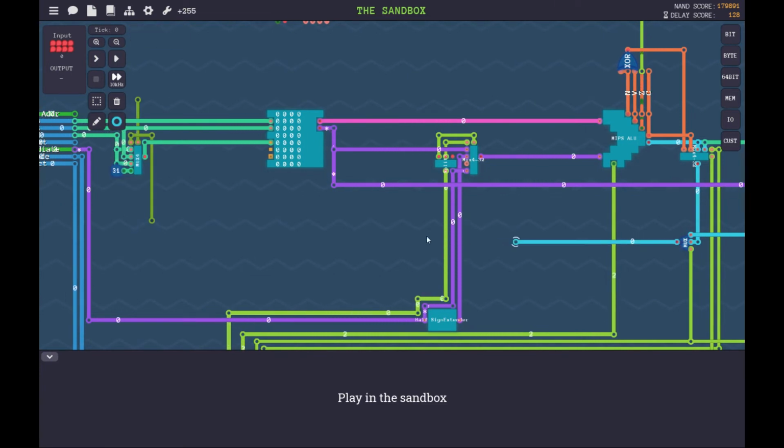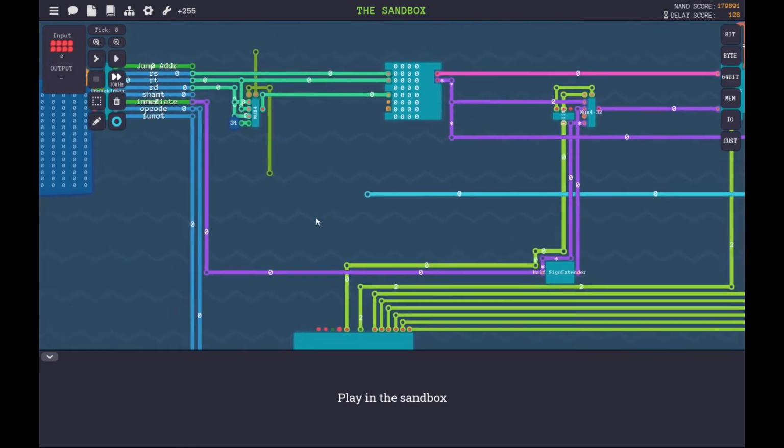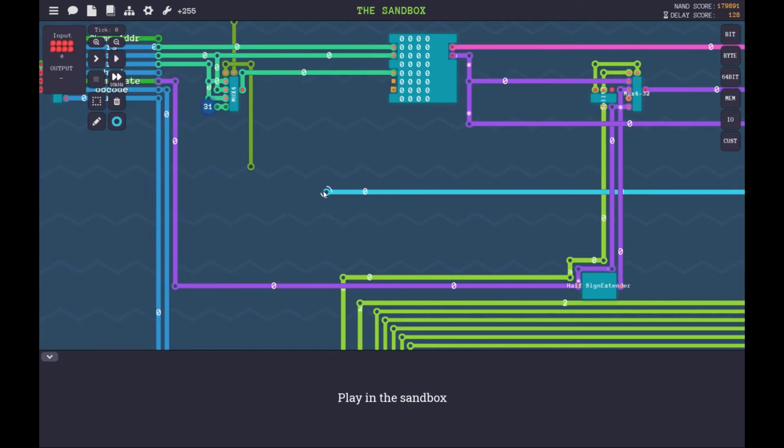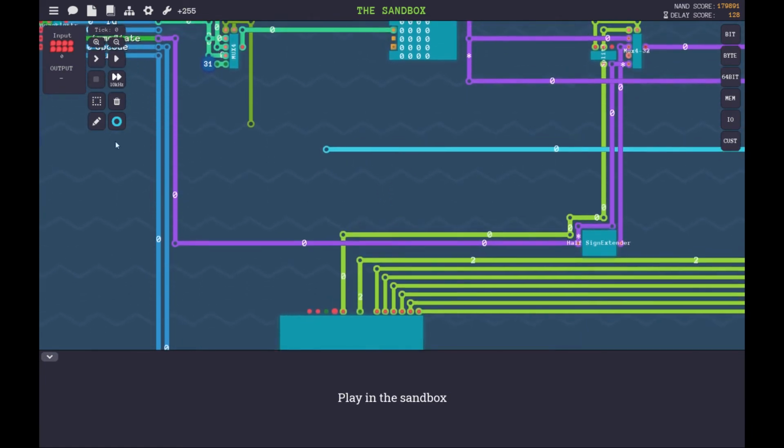This value is almost the whole result for the ALU, but not quite. The reason that it's not quite the whole result is that there is one other, let's say, type of instruction that can write data into the register file, and it's called an LUI instruction. LUI is short for load upper immediate, and this pin is also labeled LUI. And what LUI does, basically, is it takes the 16-bit immediate value and it loads it into the top 16 bits of the destination register instead of into the bottom 16 bits.